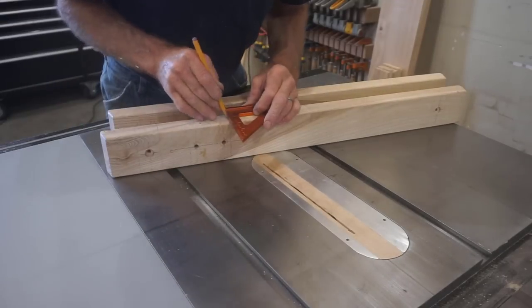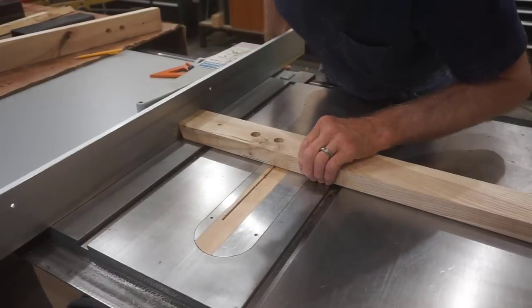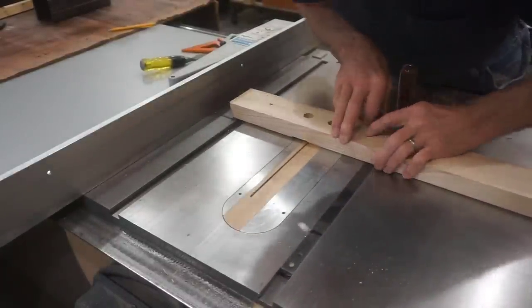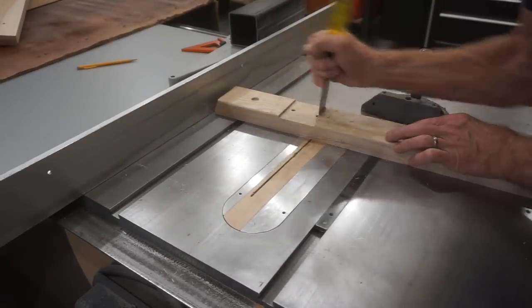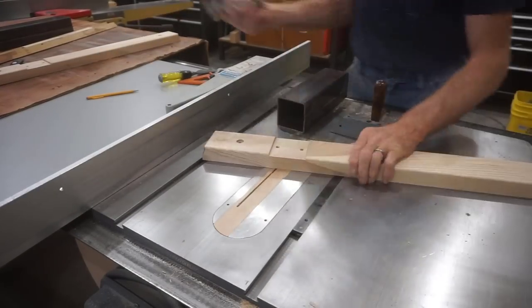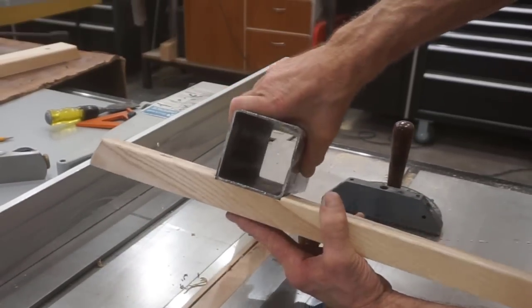I want a positive connection between steel tube and ash board, so I laid out and cut wide shallow dados on one end of each ash board where the connection screw holes are. Too lazy to switch to a dado blade, I made multiple passes with a thin kerf blade to make two two-and-seven-eighths inch wide dados. The three inch wide tube rocks on its rounded corners in the dado groove, so I whip out a sharp block plane and quickly chamfer the dado edges for a nice, firm, positive fit of tube to board.